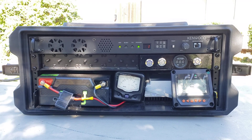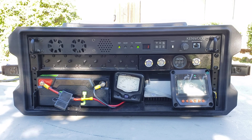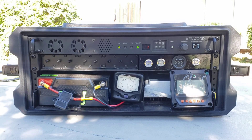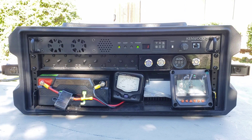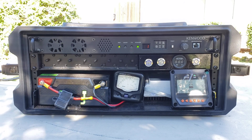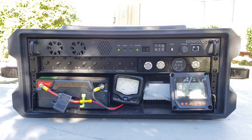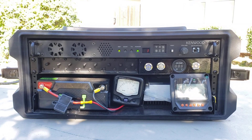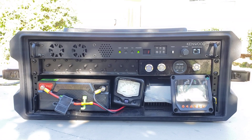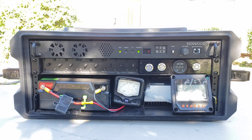If you have a high point or can put up a tower with a little 5-watt repeater, that's all you need. We're using a Gator Pro Series case — people use these for DJ equipment, amplifiers, pro audio — but I like to use it for radios. Down in the bottom left-hand corner we have an 18 amp-hour lithium-ion battery. That's important because with lithium-ion you can run the battery completely dead and get a full recharge. Also, a lead-acid battery would vent fumes that would damage the electronic components. Lithium-ion does not vent toxic gases.